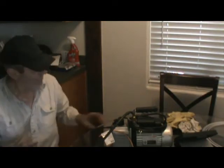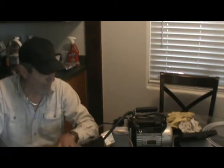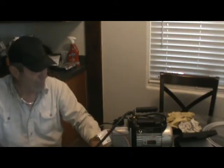It's just ridiculous. So, guys will argue that point with me, and I've been doing this 40 years. It doesn't matter in domestic refrigerators, okay? And freezers. It just doesn't matter. It's the metering device that matters, okay? And we have a capillary that's not that sensitive. It's not like an expansion valve or some of the commercial types. So, anyways, this is the process.